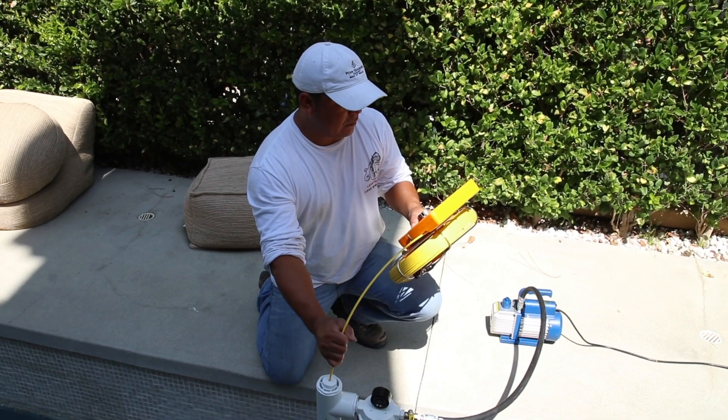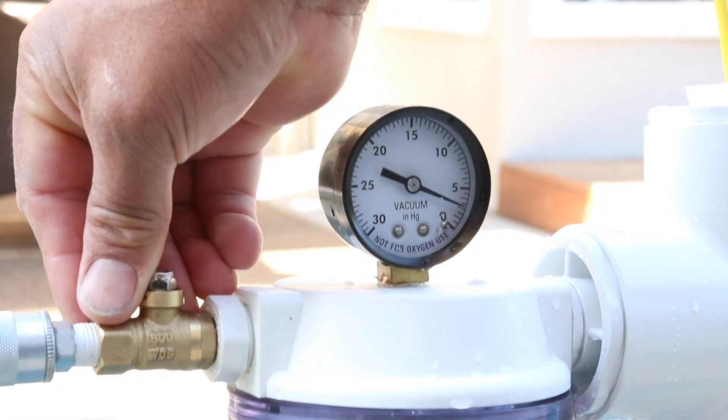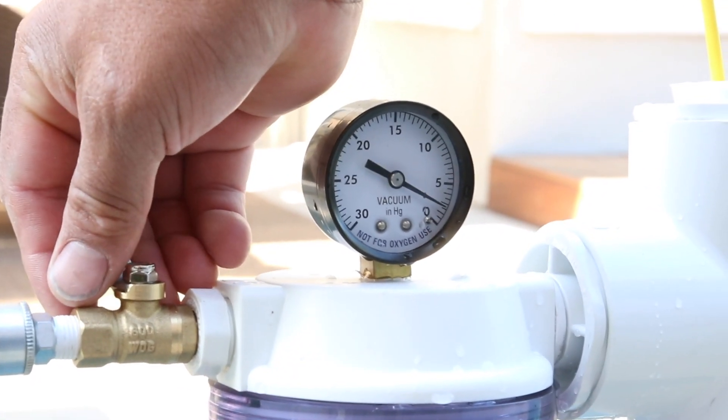We're going to pull it and look. Here's where you'll see the air — we'll speed it up a little for you. Notice our vacuum gauge to see where we're at. We always want to keep it low; anything over zero is creating vacuum. Here's the vacuum. Here's the leak. We're 10 meters in — measure it out, and we're right on our leak.